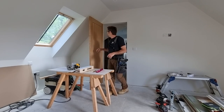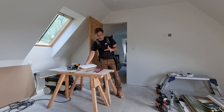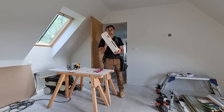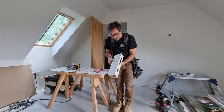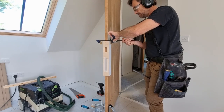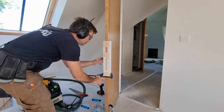We do our locks and handles next, but first we go around and swing them all to a position where there's a little block to stop them swinging right through the lining and cranking the hinges. Because these are pre-finished doors, I don't like to see pencil marks all the way around them as they're hard to get off, so I've made a simple lock and latch jig. This represents the latches, this represents the bathroom locks. You slot it over the door in the right position — these handles go exactly central — clamp it on and use the router to route out the forend and latch.